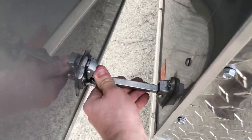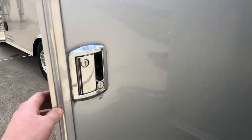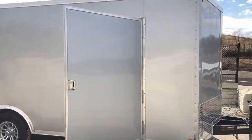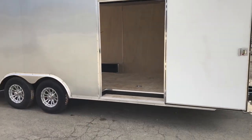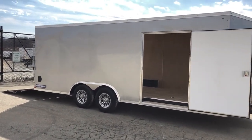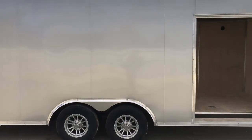The holdback on these is aluminum, not plastic. The side door has a metal handle, not plastic. It's got the nicer style piano hinge door. The door on this is a larger 48-inch door, not a 30, 32, or 36. Got a nice finished face on the door and a side door step well inside the door. Aluminum wheels are also standard. This has the thicker 0.030 aluminum exterior, not the thinner 0.024 that you often see. At the seams, it's a screwless exterior, giving that nice clean look.